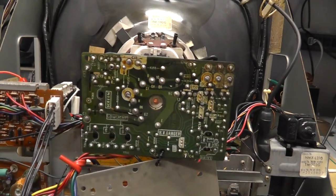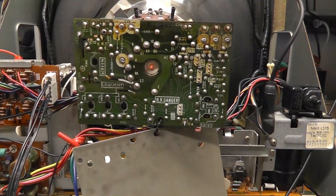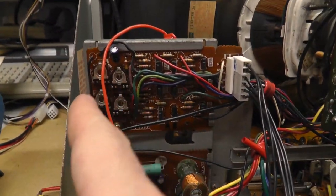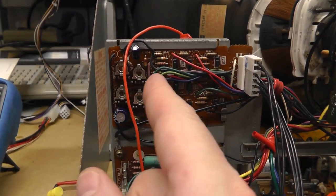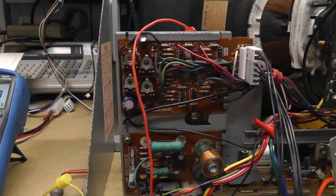But anyway, I think the monitor is pretty well adjusted. I am not going to screw with it anymore. One thing I did do is I adjusted all of the color contrast pots to their vertical position, but measured each one resistance wise to ground.